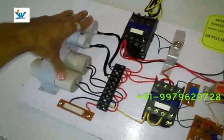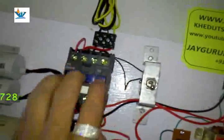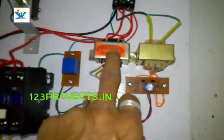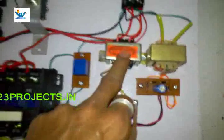When the load starts, all four capacitors will be connected via this contactor. In normal condition the contactor is on. When we switch on the project with this switch, this contactor starts, and after a second this contactor will start if there is sufficient voltage at the generated point. This potential transformer converts the high voltage to a low AC voltage.